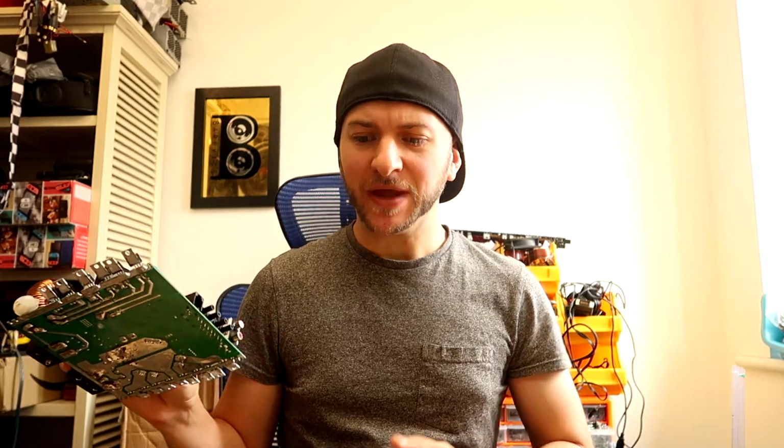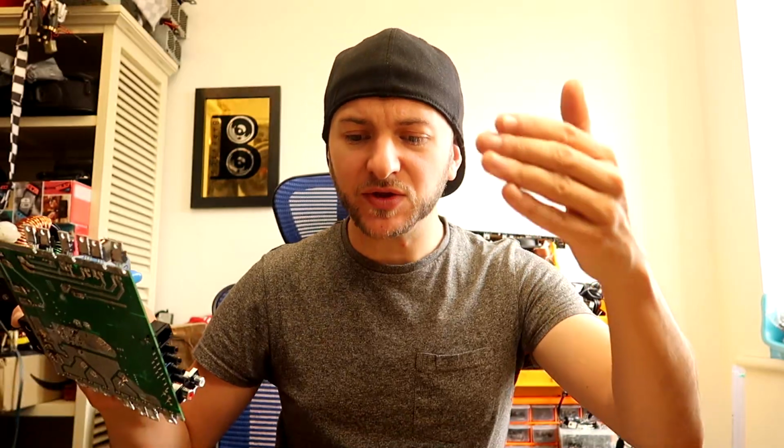While I was looking at this, something hit me. If the Audiopipe is a direct copy of the Tyrants with all the same resistor values everywhere, just accidentally too low a rail voltage, then that would cause the Audiopipe to technically go into low voltage protection way too early, way earlier than it should do based on the Tyrants, but it doesn't. So I took a close look at these resistor values between the Audiopipe and the Tyrants, and I found that they're actually different. So the Audiopipe's resistors are calibrated for its lower rail voltage. This is quite the turn of events. This suggests that the lower rail voltage of the Audiopipe was actually intentional.